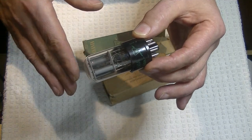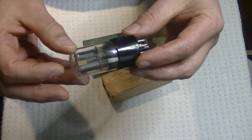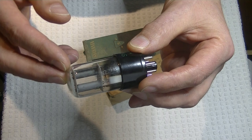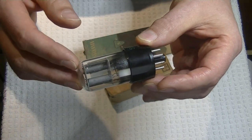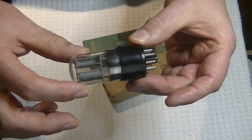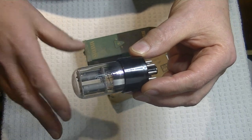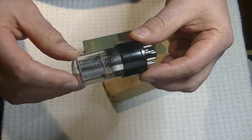The supply will be limited for sure, but for the moment we're able to haul in a fair number of these tubes from the 1940s and 50s. That 12SL7 looks a lot like a 6SN7. Well, they were made in the same years, same factory, same materials — just different plates. These higher-gain tubes have an oval or rounded plate structure which gives higher gain through design, and that was invented way back at the beginning of the first tube era. So these are going to sound amazing.